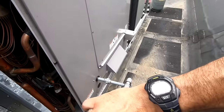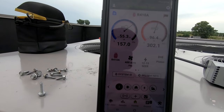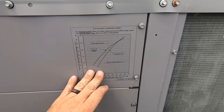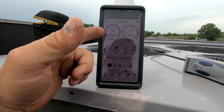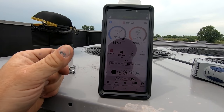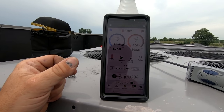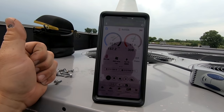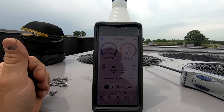We were here on the first so it's been 30 days — we lost about 5 pounds in 30 days. Notice our pressures are nice and smooth, nothing going up and down like we've got non-condensibles in it. We know we've got it weighed in and pressures are not abnormal. I can't beat the factory weigh-in method. Running a 55-degree evaporator on a variable air volume system means zones may be calling or not calling, motor ramping up or down, so I just want to make sure we're not seeing skyrocketing head pressure or dipping suction pressure — neither is happening.